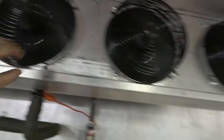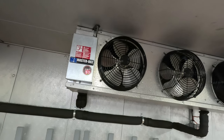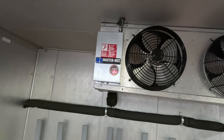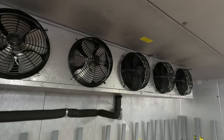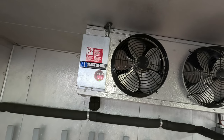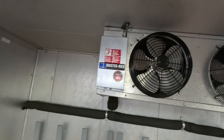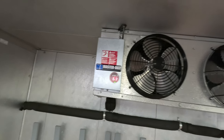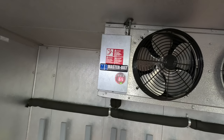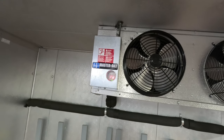We need to adjust that one more time — these have been torn apart so many times nothing's back in the right order. The little 'D' and little 'N' means the defrost sensor. You can see how fast we're coming up — 57 degrees. We're going to hit 65. I went ahead and set it to 60 instead of the 80 they had. The fan in the middle — something was hitting — so the delay it takes to get back to temperature should kick it out again. We're at 61. Once you're thawed it'll start jumping up really fast. There's 63 — should kick out here. There's 64. There's 65, 66 — yep, I think I just heard a change.